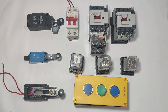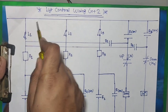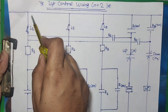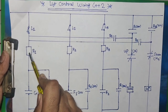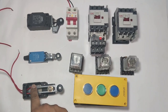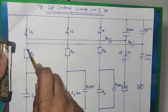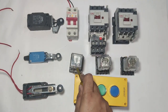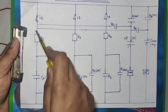Let's start wiring — first see the drawing. The line connects to the L1 limit switch NC point (ground floor limit switch NC). The NC output connects to R1 relay coil, which is pin 10 of the 11-pin relay (pins 2 and 10 are the relay coil). Line connects through the limit switch NC to the R1 relay coil.